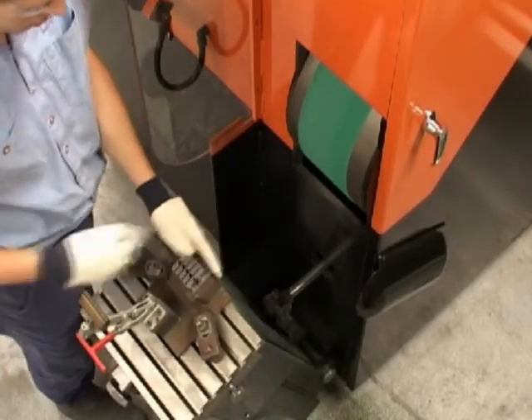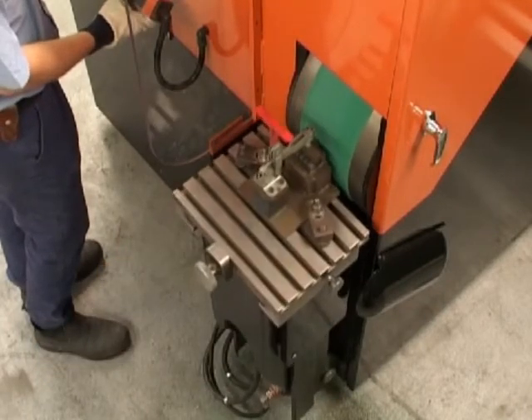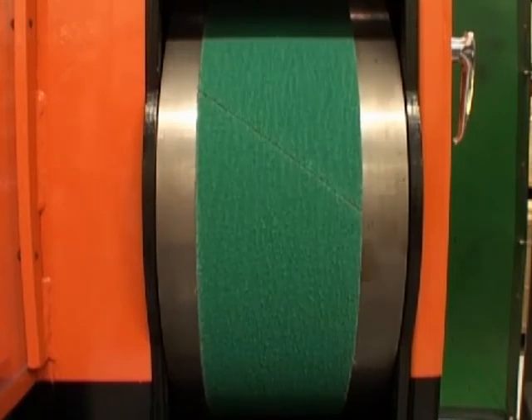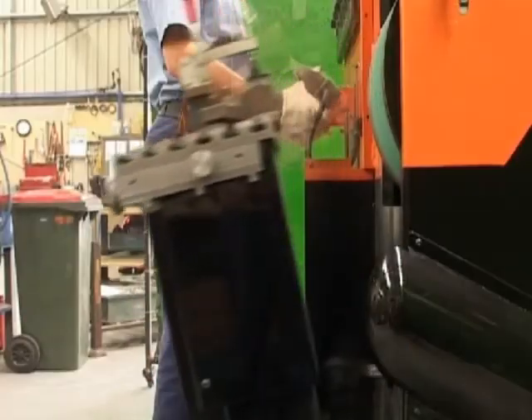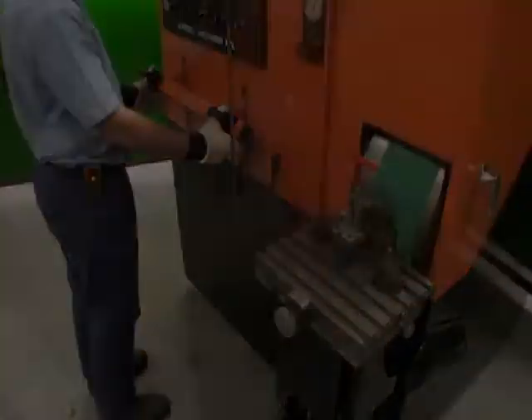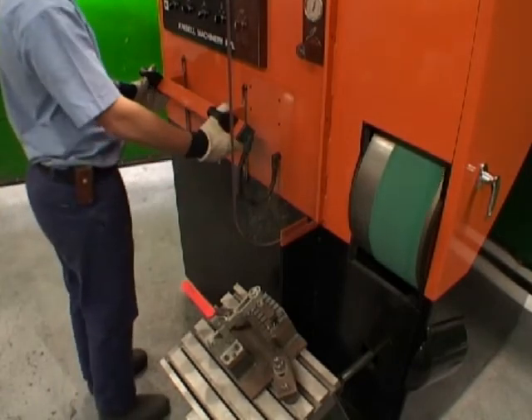The RGS machine has a perfect safety record in over 15 years of operation with AW Bell. With the emergency stop instruction, the machine goes into recovery mode and the belt comes to an automatic stop. The plunge table immediately retracts. Both cycle buttons must be operated simultaneously — if one button is held on, pressing the other button will not operate the machine.